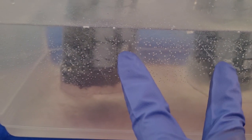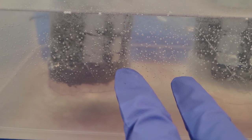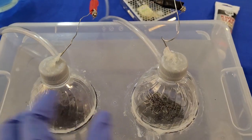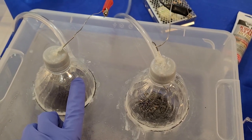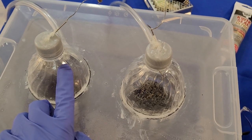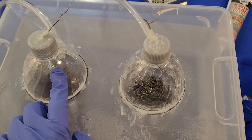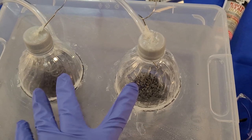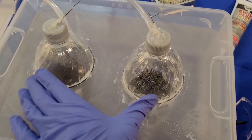What I'm going to do instead is connect both of them using a vinyl tube, right? That's for ionic transfer. And then the rest, I'm just going to do the same: anode, cathode, and 2 vinyl tubes coming out of them. This makes it compact, obviously. And the other thing it does is it also helps me to build more of these units, and then I could cascade them. So this is one set, right?